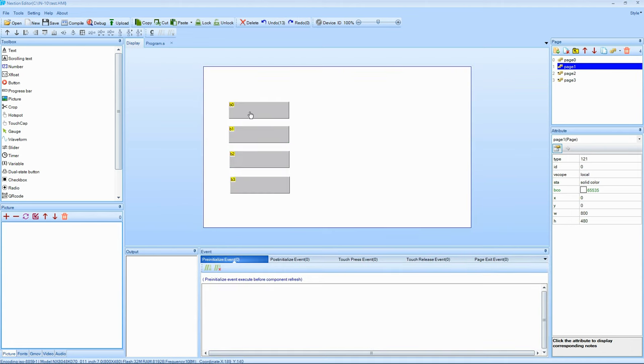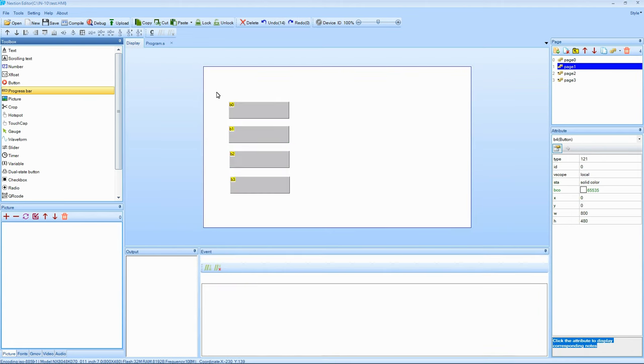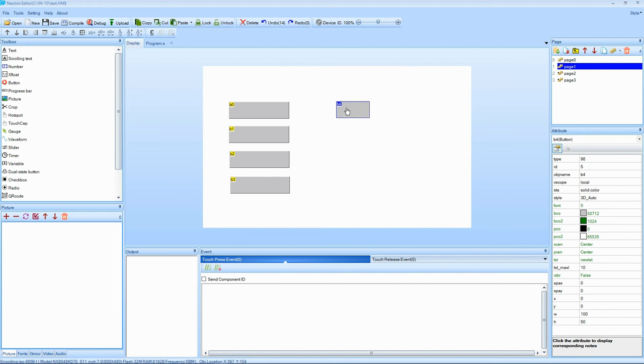Each button icon has a little designation up in the top left-hand corner. I don't know if you can see it or not. It's pretty small. Like there's a B0, B1, B2, B3. This is the text I need to write into the PIC microcontroller code later. These buttons, when they get pushed, they'll send data out with another number attached to that icon designation. And this is what the PIC's going to see and know what to do with as it comes along.